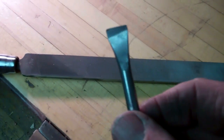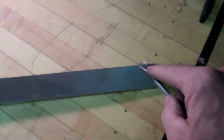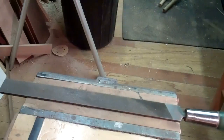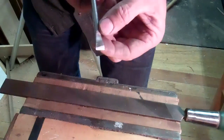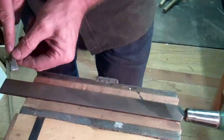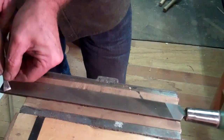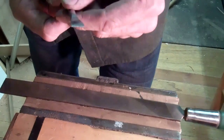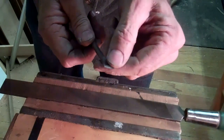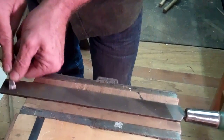This thing has worked out quite nicely. The concept is: once you get it flattened off, you take it and start rubbing it on one end — put it in the vise — rubbing it until you create these little tiny teeth. Those little tiny teeth will actually clean out the file. What you do is take this flat that you've ground on the grinder and put it at the beginning of the groove and start going back and forth. Immediately it starts cleaning it out, but you keep working diligently until you cut a bunch of little teeth. All those little teeth will re-register in the next run, and you can see it's cleaning out all the old debris.